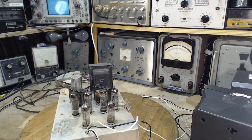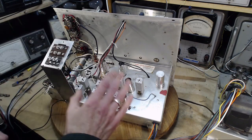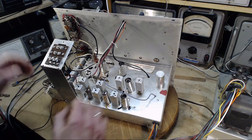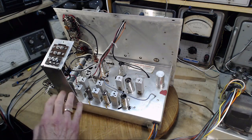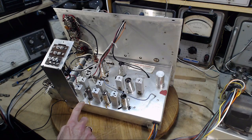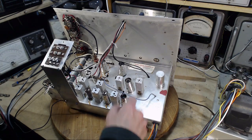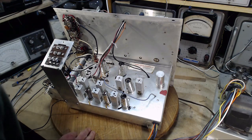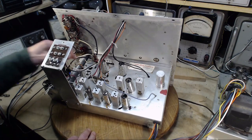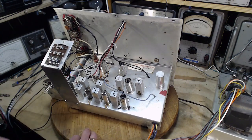Time for the receiver to come in now. Okay, so here's the receiver. I should take a good look at it before I operate it. Very shiny, very clean, another sign of very low use. Here's the tube rundown, stamped right in here: 6BA6, 6AU6, 6AL5, 12AT7, 12AX7, 12AX7. So something E6 over here that's unfortunately solder on. Oh, it must be a 6BE6 and a 6BA6 down here.